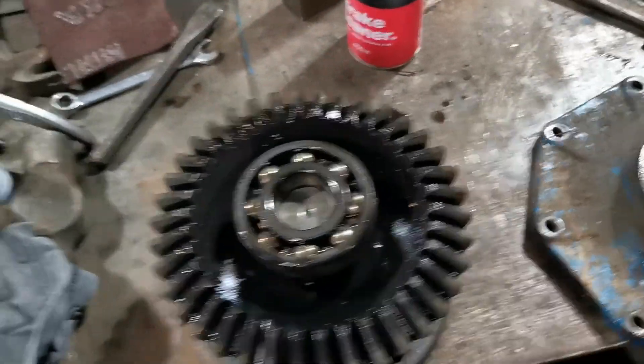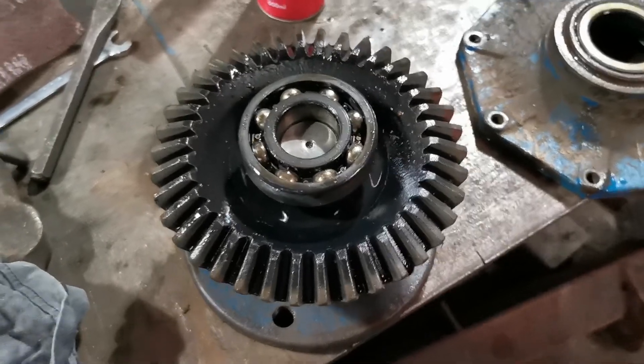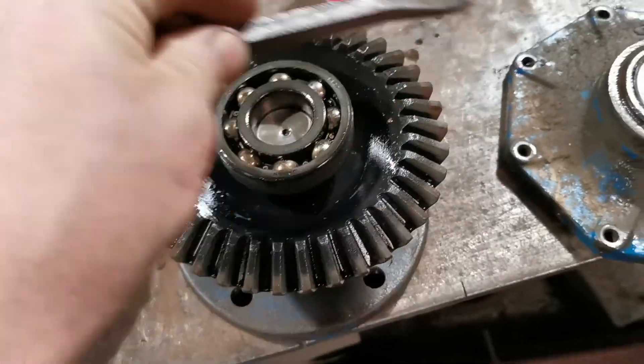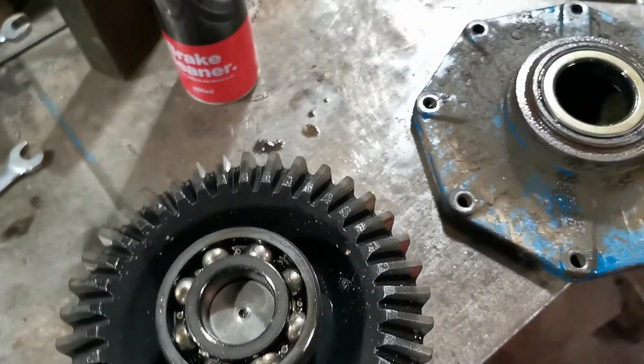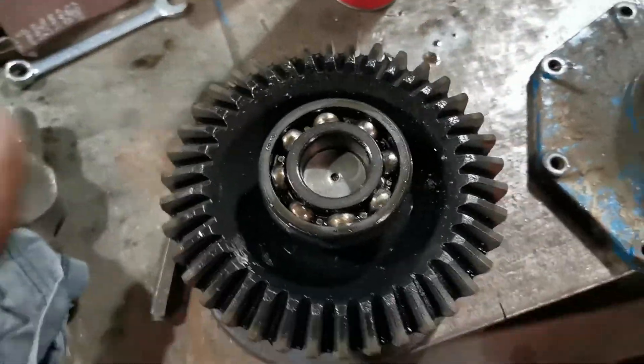This is apart, but I'm going to show you how it came apart because I couldn't find any resources on it, so let's give someone something useful. We have a bearing on here which is over what looks like a massive crown wheel — that's just held on by an interference fit. I got the chisel in there, drifted that up, then after I'd done that a three-arm puller over it pulled it off.